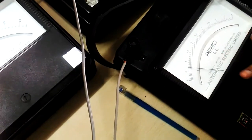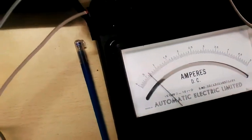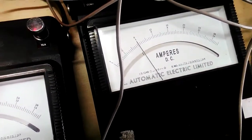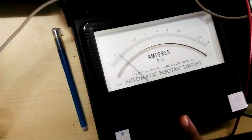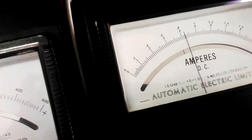The generator current is around 8 amperes, and the motor field is within the permissible limit of 0.5 amperes. We now take the readings: I1 is 3.8 amperes, I2 is nearly 8 amperes, I3 is around 0.6 amperes. The field current of the motor is 0.6 amperes and the field current of the generator is around 0.8 amperes.